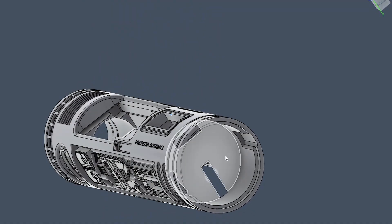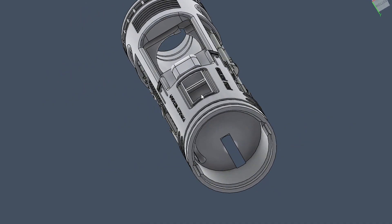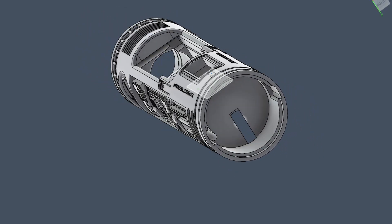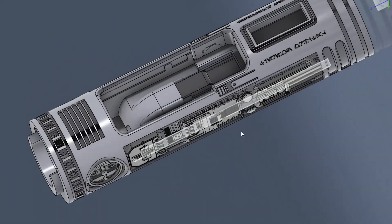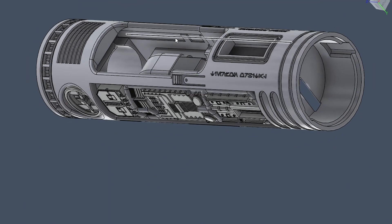Starting at the bottom: 31-millimeter speaker, fully enclosed. I had 34 and a half millimeters on this chassis — it was a big one. There's plenty of room for an OLED. The client requested Bluetooth, so since I have the room I went all out — we've got an OLED screen here, a channel where I slide the OLED in and bring my leads up through the wire management channel. The Bluetooth module has its own tray, and the CFX sits in this area. It does slide underneath this lip if you need to get at the USB slot.